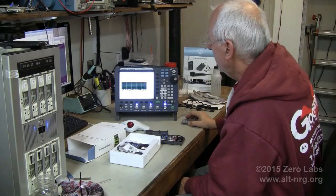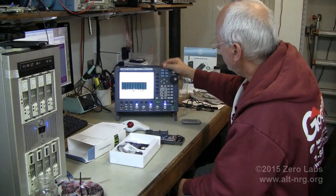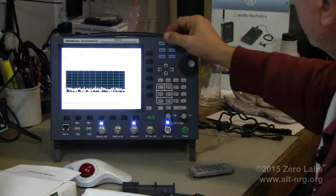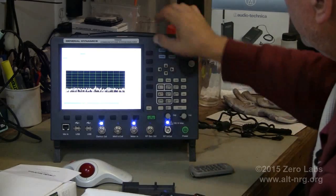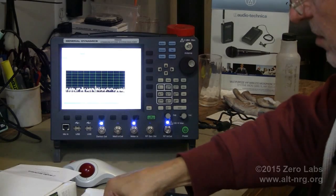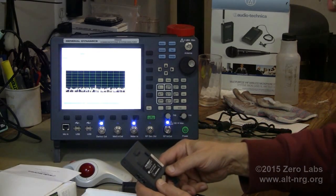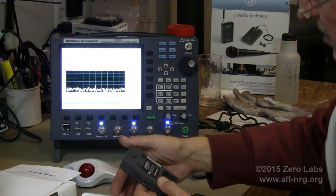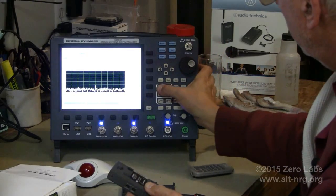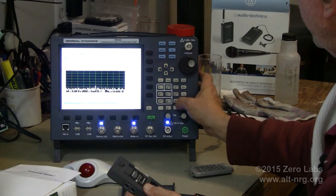We are in the UHF range. I'm preset to 463, 468 megahertz. We're going to change that. So go to, let's see, turn off my RF source, go to RF zone, change my monitor frequency, and my transmit frequencies on this particular transmitter are 169.505 and 170.305. So 169.505 megahertz.